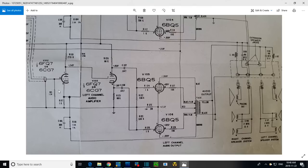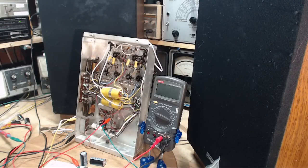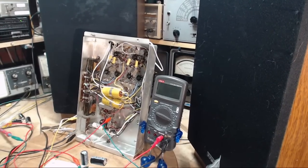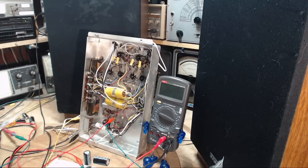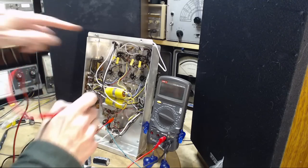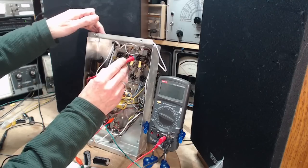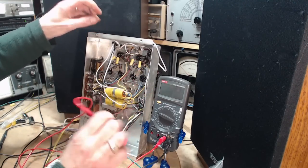There's really no reason why we can't compare all the pins of the two 6FQ7 tubes. But we'll start with the one that we believe is causing the hum, or is related to the tube that doesn't behave like the rest. The misbehaving tube. You bad boy. Well, I don't think it's a tube. Well, I don't know. I think it's a circuit though. So what we want to do is measure the voltage relative to the chassis on these two tubes. And we can literally go pin 1, pin 1, pin 2, pin 2, just work our way around and watch what happens on this meter.